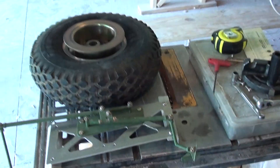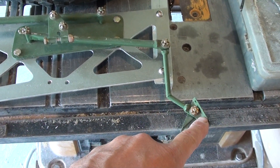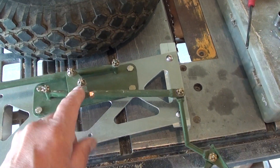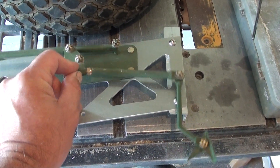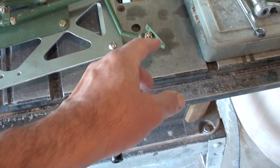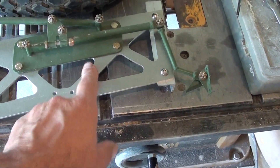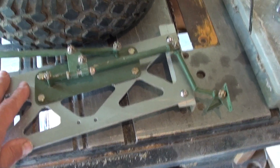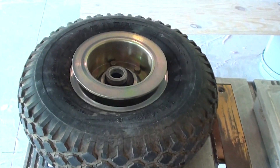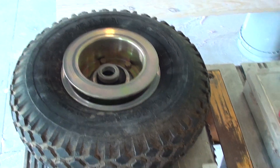What I've been working on now is the mechanisms that pull the gear doors closed. Everything works off of this cam follower that rides on part of the landing gear retract mechanism. These go down and hook to the doors, one on each side. I cut these out on my CNC machine — I made a video on that. I'll either add it to the end of this one or upload it as a separate video. It was probably 10-12 minutes long. And that's one of the wheels.